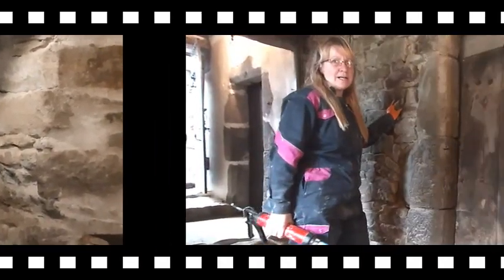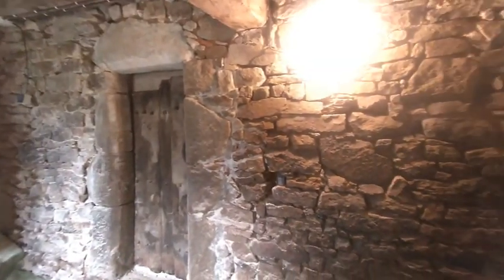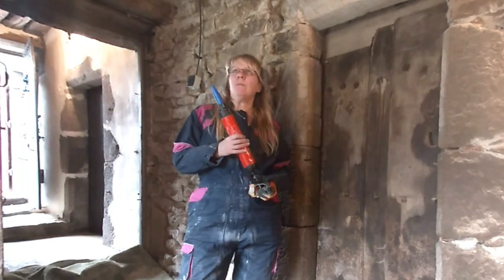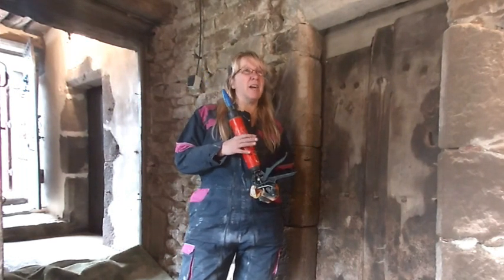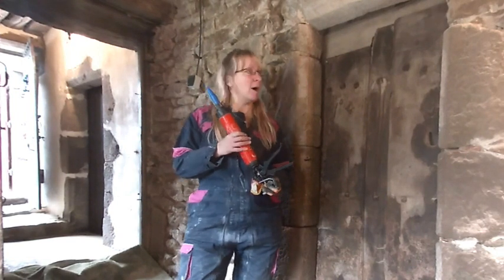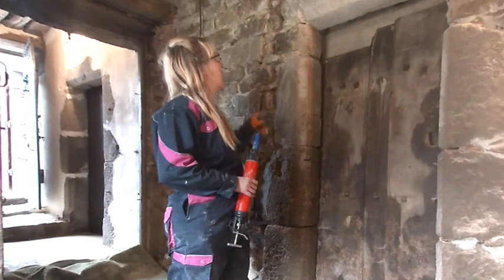But I'll show you. Okay, so I've cleaned out all the stone, brushed it all out, dug it all out, brushed it down, hoovered out all the cracks and crevices to make sure there's no dust in there. Now, a lot of people have said, why don't I use a mortar gun? The reason is that I actually just really like the technique that I've got using my hands. But with this wall, there's a lot of small stone, a lot of small gaps.